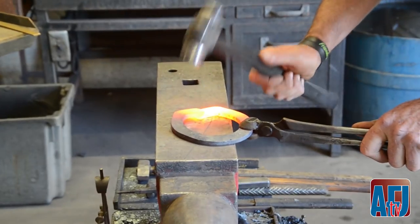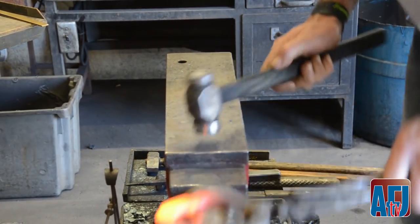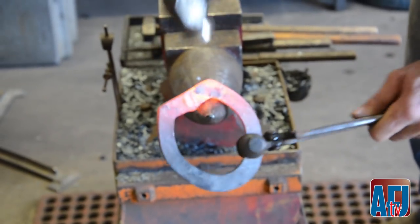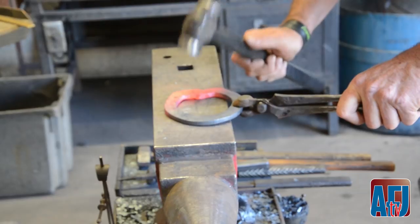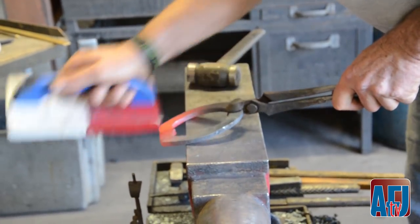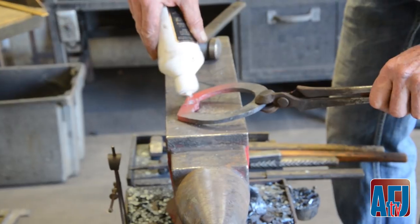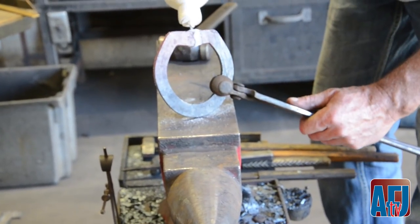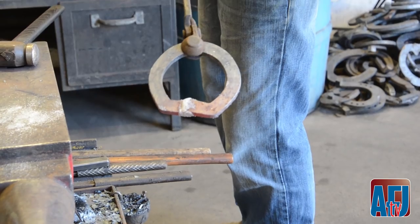Just going to take my hammer - it's almost like I'm welding hammer blows but I'm pulling the edges together with no plugs. Just getting all the daylight worked out of it and getting everything looking like I would like it to look. Getting all those seams kind of cleaned up and tidied up. Because the more I can do before I actually weld, the less work I have after I'm done welding. Now with some heat on it - it's very important to do this with heat so that sand sticks to it. You do it when it's cold, half the sand rolls off before it ever melts on there. Everything is encompassed so now we have a nice shroud.